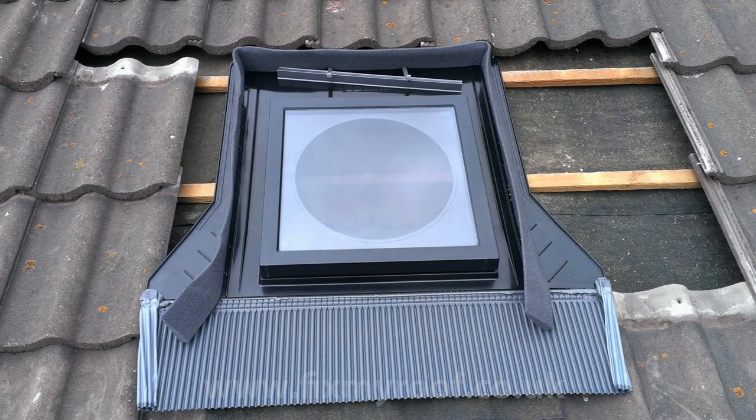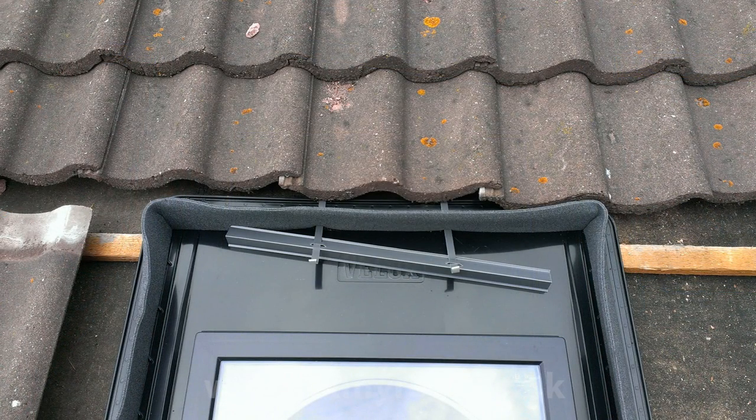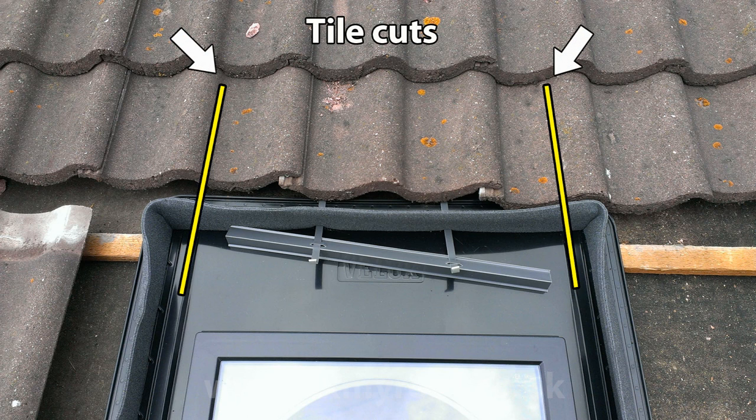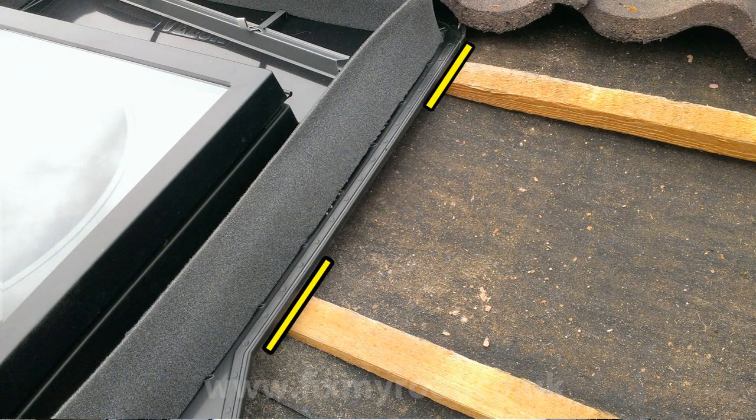I always like to lift the external sun tube window onto the roof to check the angle of the tube and see how it fits between the rafters. As you can see the angles look good, so now I'll check to see how the flashings fit in relation to the tiles. If it's possible, try to make sure any profiled tiles end up so that the flashings are covered by the tile and preferably finishing on the downward slope of the tile's profile. It isn't essential, but sometimes by just compromising and moving the unit left or right slightly it will make everything sit sweetly.